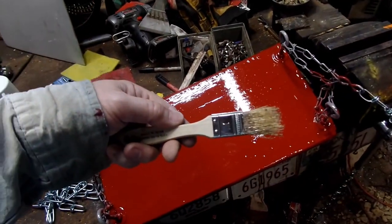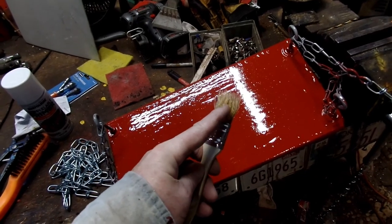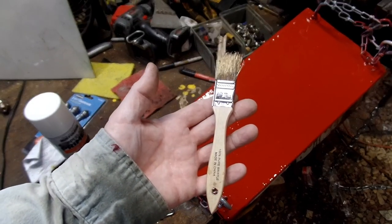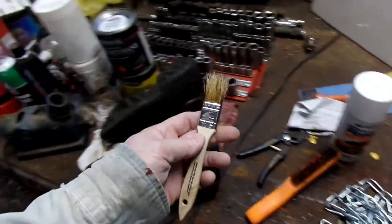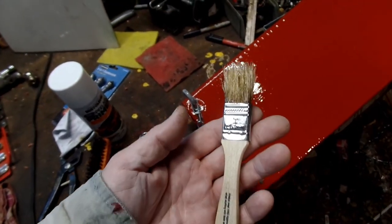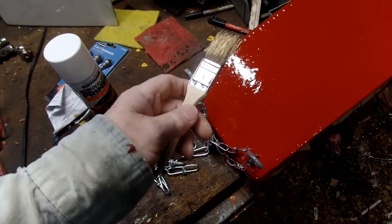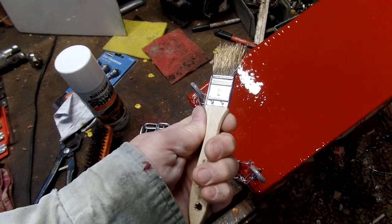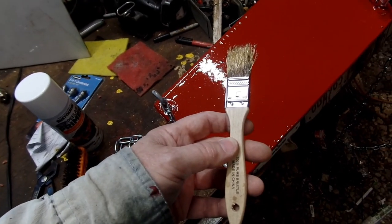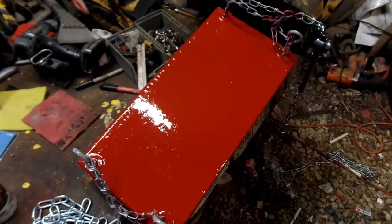One tip I want to give you guys: these are sometimes called chip brushes. They're mostly used in machine shops and you can go to Harbor Freight and buy a box of them — this one is hog hair. For throwaway brushes, this is what I use. I buy a box — 20 or 30 of them — and honestly when you're working with polyurethane and paints, how are you going to clean a brush? Unless you want more chemicals and more work. I use these as throwaway brushes. They also have them in two-inch and three-inch sizes. Acid brushes are the real small ones I also use. A good tip when you're painting and doing projects.